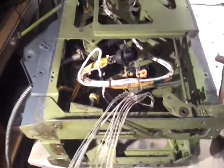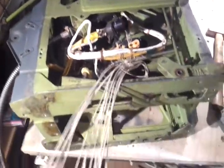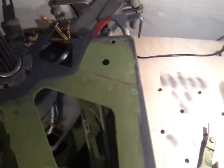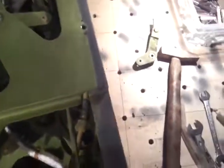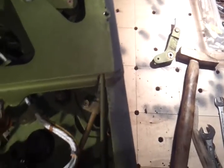Hello. I started the disassembly of the throttle quadrant now. The first steps are just to take out some parts which are not needed. For example, this is some kind of lever for the parking brake. I'll remove it, and at this place there will be a small servo motor which will push this up or down, or some actuator — I'm not sure yet. So the next thing I'm working on is just getting rid of the cables, at least getting rid of the plugs.